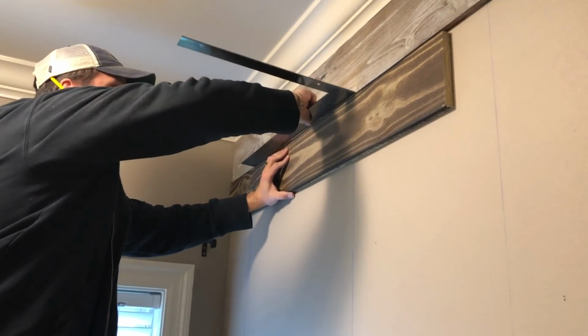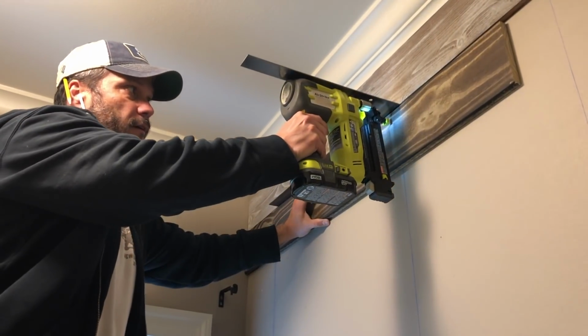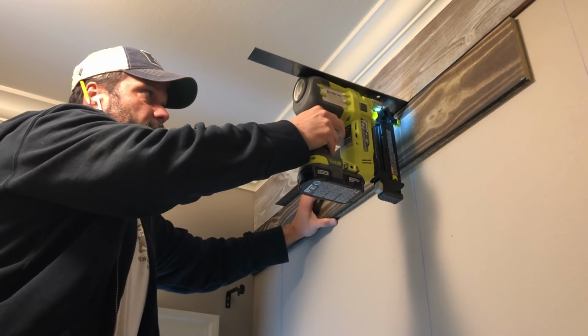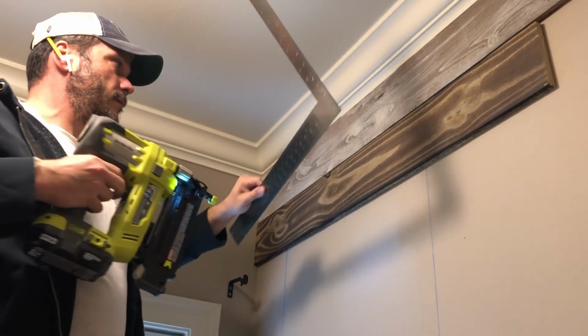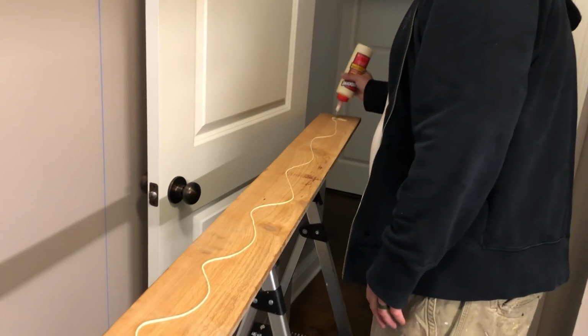Can you hand me the nail gun? So what we do is bring it right to our chalk line. Ta-da! Gave us just enough width and kept it even all the way up and down. Yep, it looked really nice. And then what did we do? So then you bring your pieces in, you just put them in dry, just make sure that they fit. Then you would take wood glue, put it up against the wall, and then nail away.